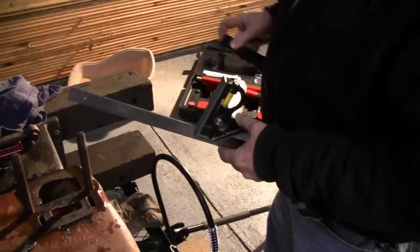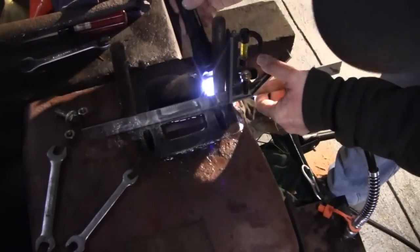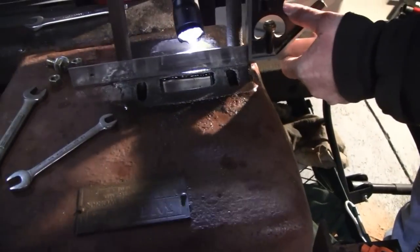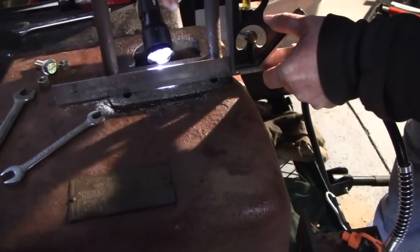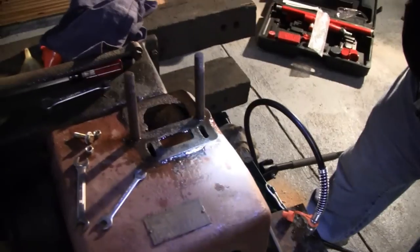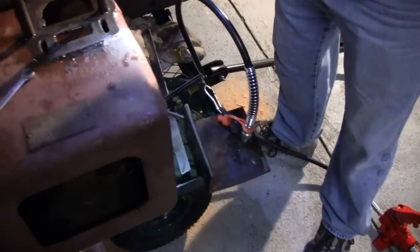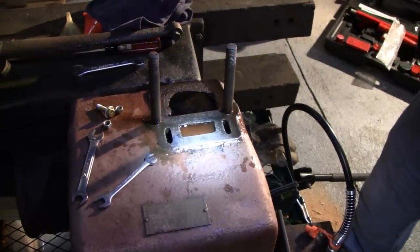All right, I found out our problem, buddy. Can you check down here with your camera? Look, that engine is not even close. This is a straight edge. And this side here is a little better. But I think our problem is right here. So we got to try and get that warp out of that. That's our problem. It's not our plate. Our plate is perfectly flat. All right, so let's see what we can do with that.